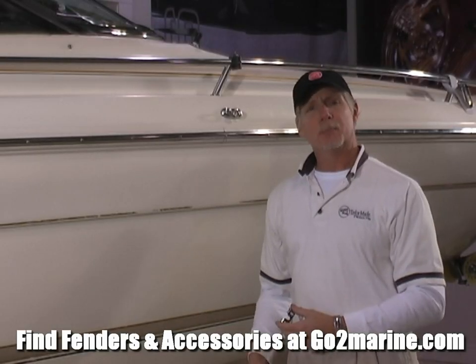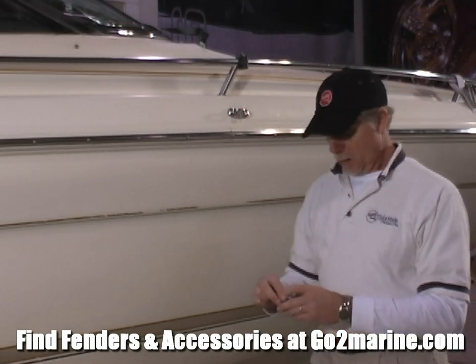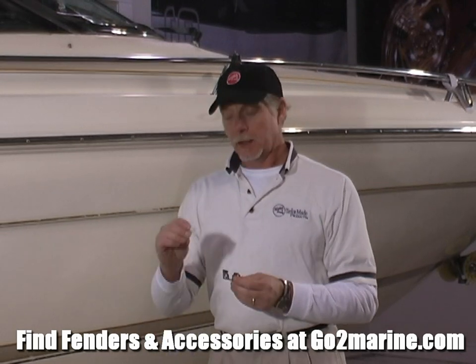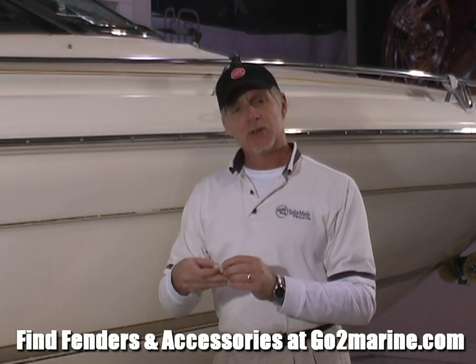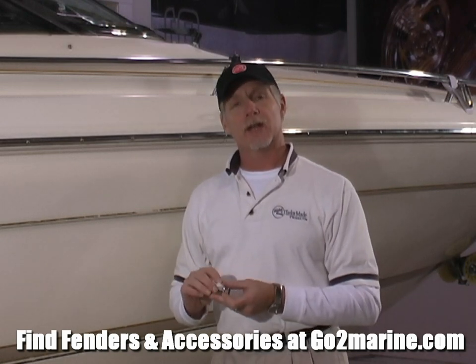Okay, a less expensive alternative to our cast stainless steel fender bracket is our Model 1010. This is a stainless stamped bracket, and it comes with an injection molded peg instead of the stainless one. This is for smaller fender applications and uses up to a 1/4 inch diameter rope.